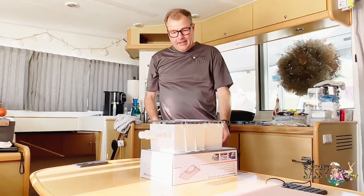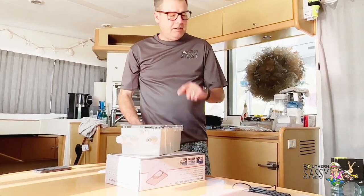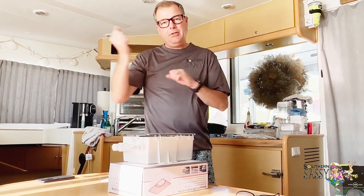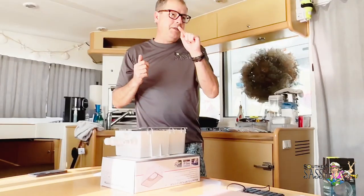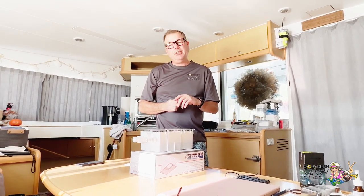So this is a shower sump pump. What we have in the three showers on board is just a pump that connects to a hose, and you hit a button that goes through a relay capacitor that runs it for 15 seconds, which is entirely inconvenient when taking a shower.